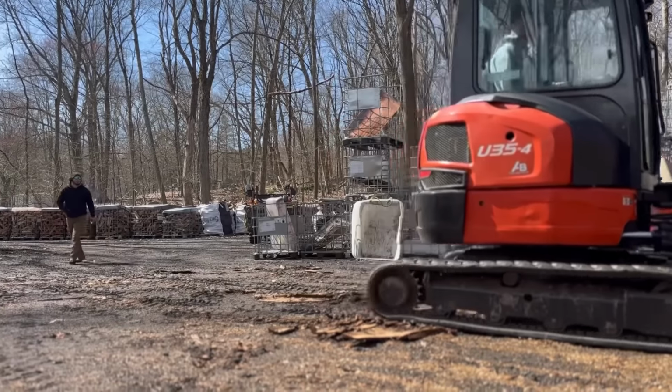So what Adam is going to try and do here is something that I was curious about as a new excavator operator, and that's that the curl function of the bucket is a lot stronger than the thumb hydraulics, and I was wondering if it was okay to curl the bucket and just have it retract the thumb, and Adam said it's not. Ideally, you would want to be curling in your bucket and retracting your thumb simultaneously, and he was saying that he still has trouble at times even on his machine where he drops logs because you're doing one faster than the other.